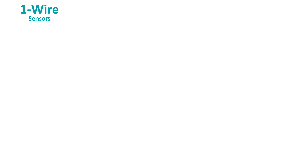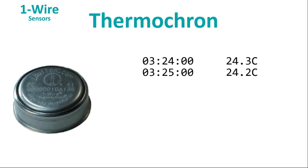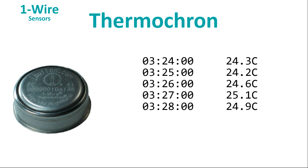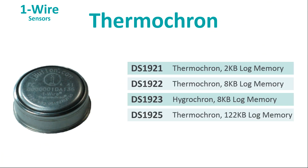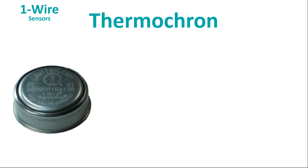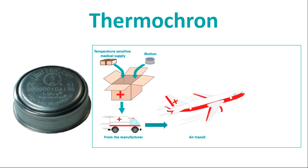Another application for temperature measurement is a stand-alone Thermochron in an iButton form factor. Thermochron is just a fancy name for a temperature data logger. On a configurable schedule, the Thermochron records and time-stamps the temperature it sees, creating a log of the environmental temperature that can't be altered and can't be forged. Maxim's data logger product family includes four members, including one Hygrocron — a temperature and humidity logger. The use case is clear: if you're shipping items that need to be kept refrigerated, such as medical supplies, just toss in a Thermochron. It doesn't just tell you if the temperature goes outside limits, it tells you when and for how long. A tiny battery keeps the device operating, and authentication mechanisms mean the results can't be altered or forged. Scan the Thermochron when the package arrives and the complete tale is told.